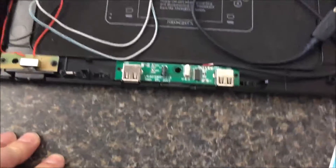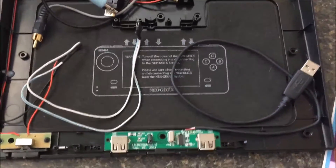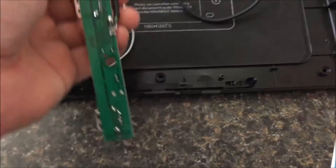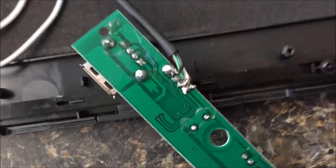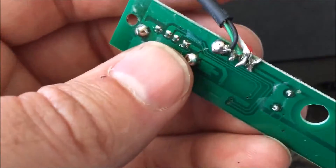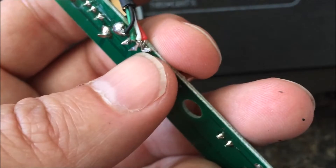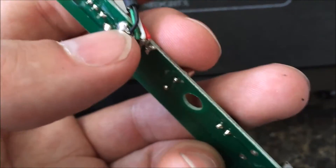Lastly, this part was a little bit tricky because of how the system is set up. If you look in the back here — my crappy soldering — as in the previous video I kind of went over this briefly. On the bar right here: the red one is your power, the white and the green are your data lines, and the black is your ground.